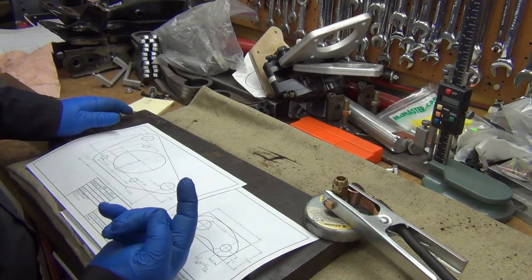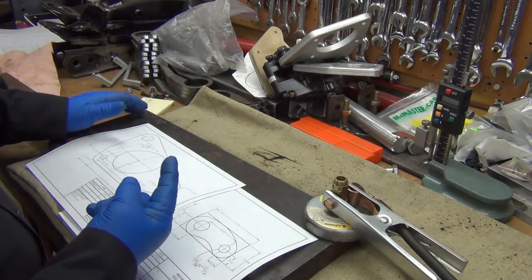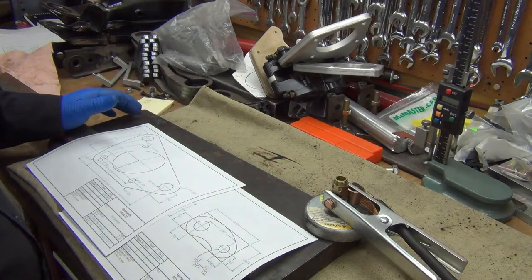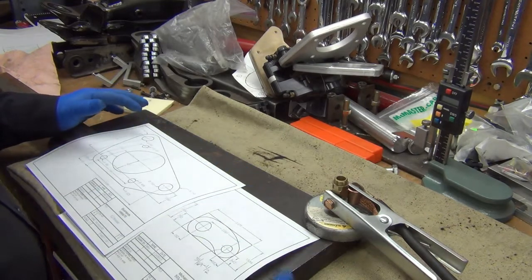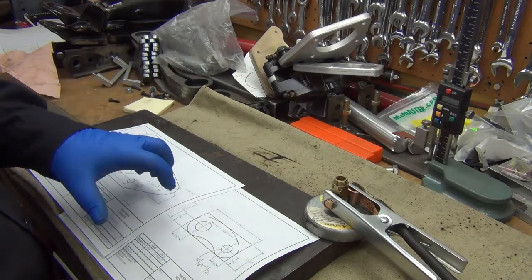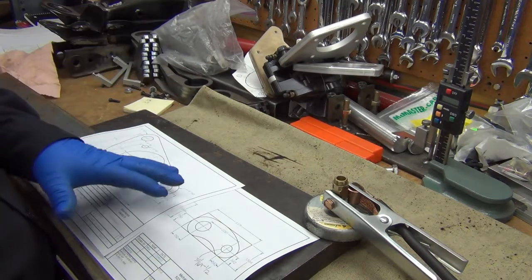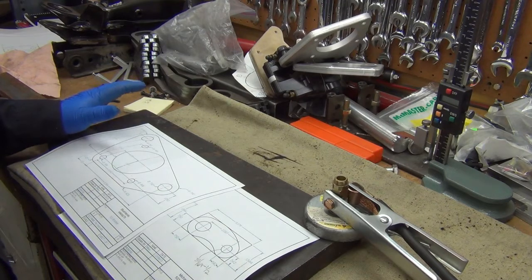I can't get underneath that tab very easily — if you've seen any of the other welding videos on the brakes, I can't get underneath and all the way around, and certainly can't do it in one pass. It's a real tedious way to fix them if I have to do perimeter welding. I'm going to give plug welding a try. I don't want to send a large order to the laser cutter and then find out something won't work — like I did with the upper control arms for the ball joint modification, which I now have to change and reorder.